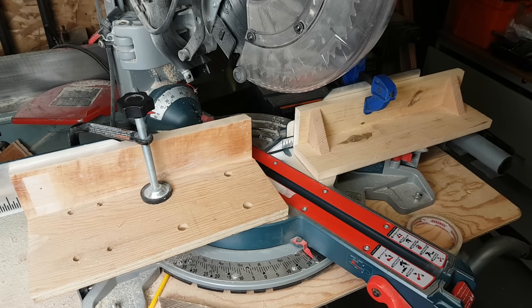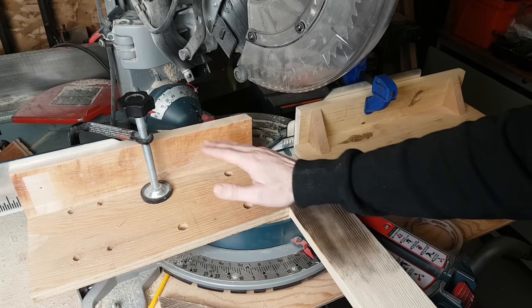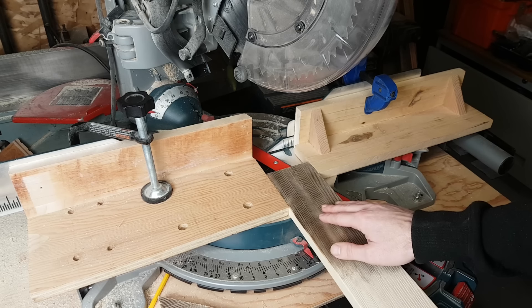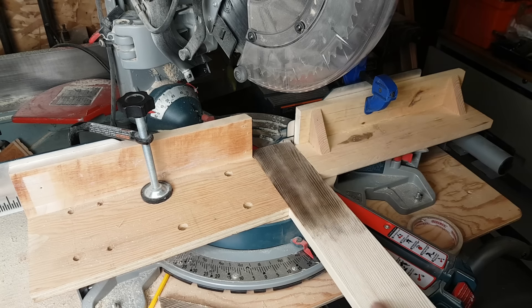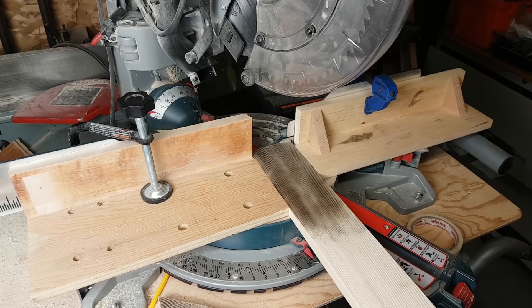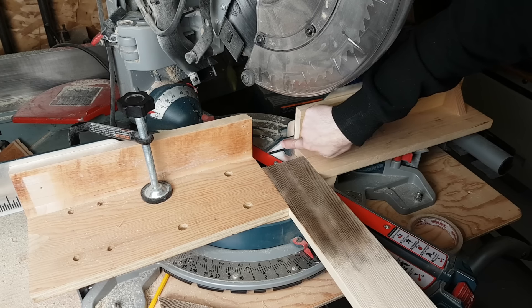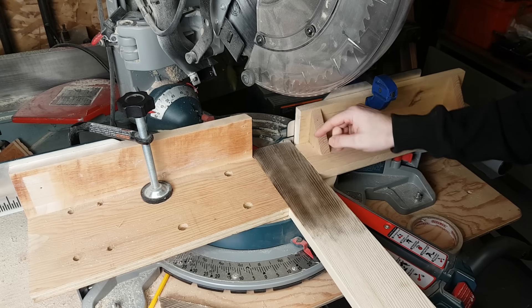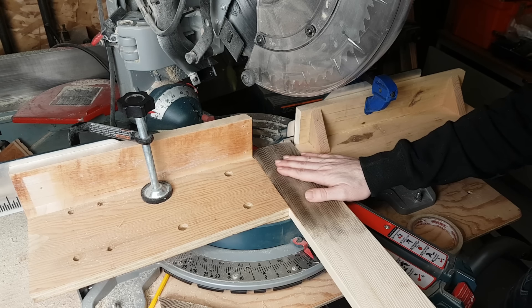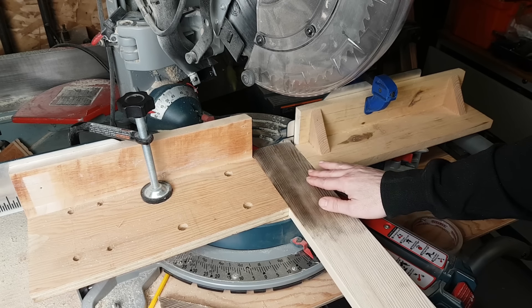Here's the setup for the final piece. You're going to set your saw to 22.5 degrees. What I've got here is a makeshift steep angle jig — I don't have any videos on how to make one of these, but it's basically just a piece of plywood clamped down at 90 degrees. I've got one on this side too, and this allows me to slide the piece in and hold it in place while making a very sharp angle cut. There are definitely better jigs out there for this. One important thing to note is that you have something for your 1x4 to rest against, because when the blade is spinning it's going to want to pull your piece of wood that way. Do be careful with that. Use your power tools at your own risk. Let's move on — I'll make the cut at 22.5 degrees.